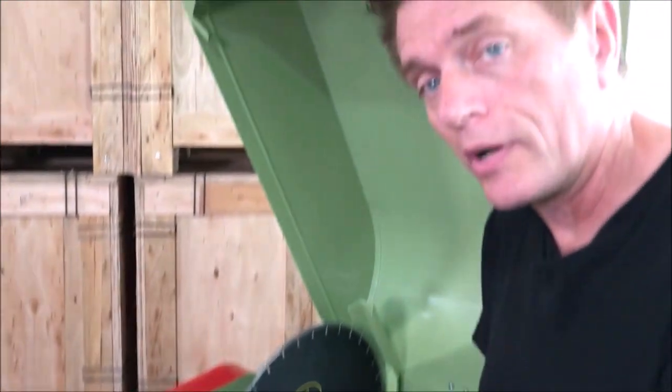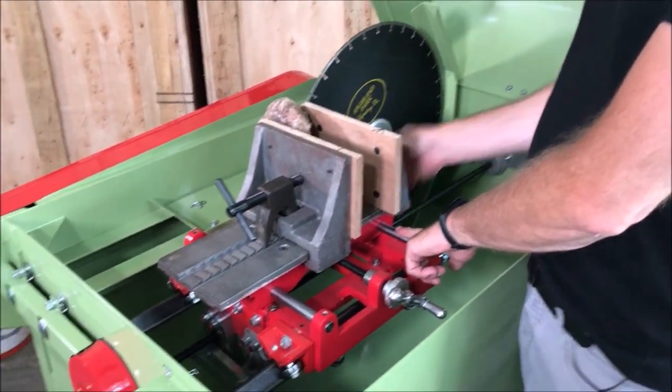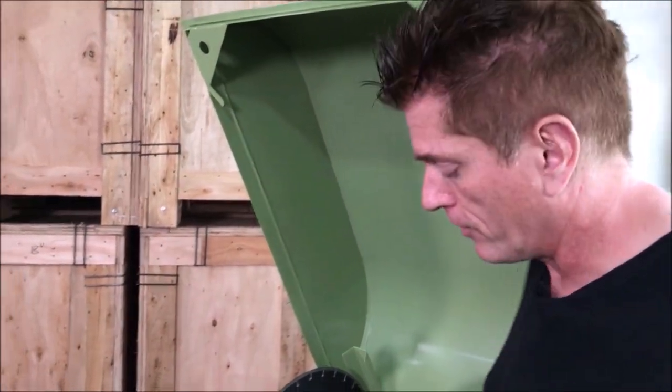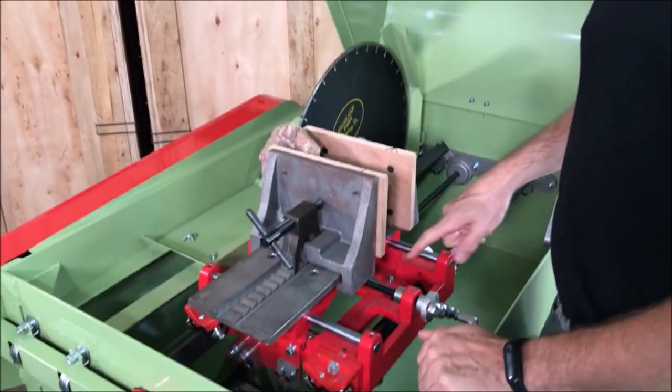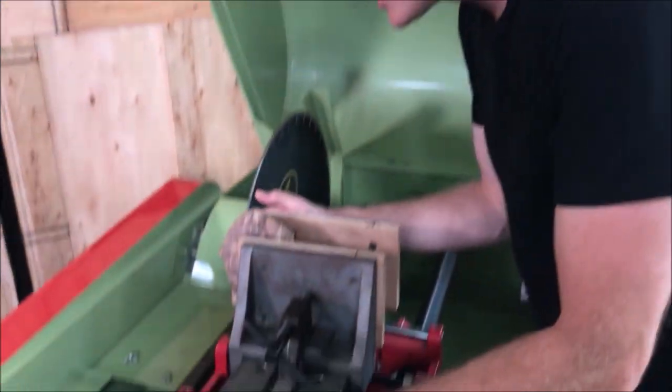Now, yes, that's more complex to machine because we have to hold tolerances of 2 parallel shafts here. That's why you'll see other saws that only use 1 rail, because it's easy to put a single hole through. Having 2 holes perfectly parallel is fairly difficult. We have videos up on our channel where you can see how we machine these. So we use 2 rails, and that affords this to be extremely rigid.